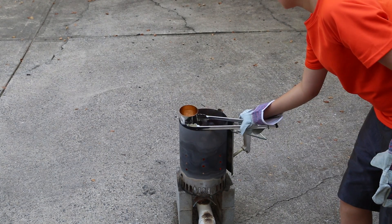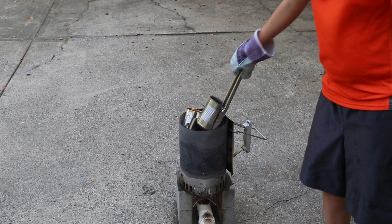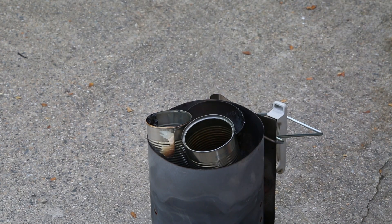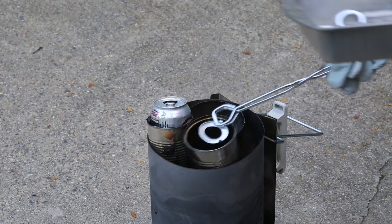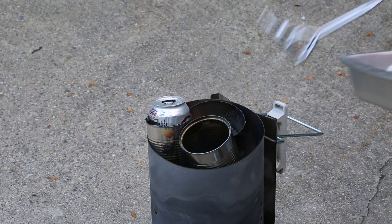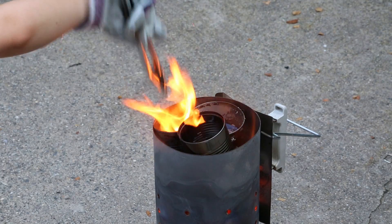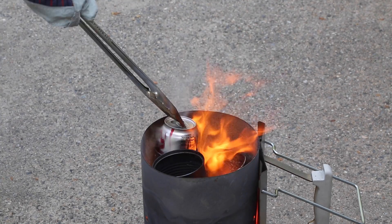Turn on the hair dryer and that will help the coals burn at a higher temperature. Once the coals are red hot, put in your cans. You can use tin cans for your crucible, but be sure to clean and dry them. We inserted the hard drive platters first, then an aluminum can. The aluminum heatsink and various aluminum pieces went into another can. After a few minutes, the cans will start melting and you can add more cans. We kept adding cans until we had inserted about a pound of cans.